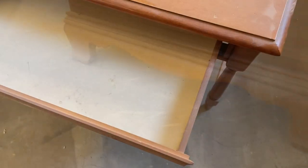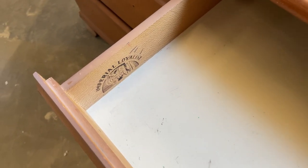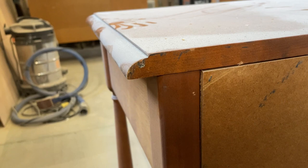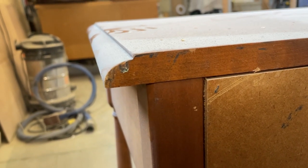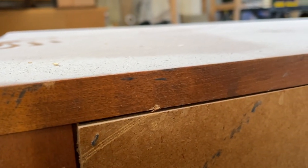is solid wood or has a veneer on it is to take a look at the back of the piece. You can usually see quite clearly if it is one solid piece of wood, or if it had a veneer, you'd be able to see a distinctive thin layer on the top.